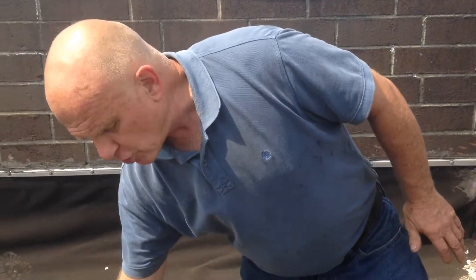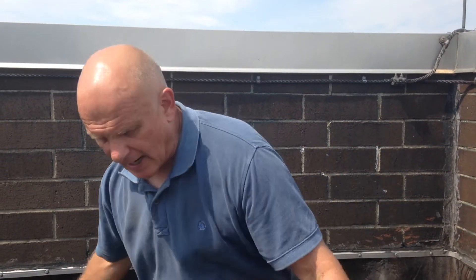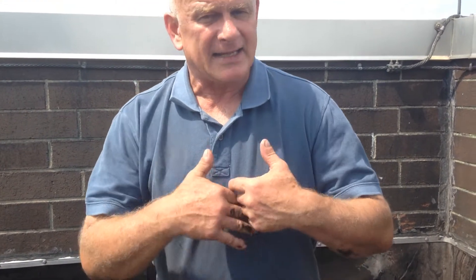But this is not the end of this roof. The best thing to do is to add another ply. We call this a single ply roof — now you add another ply of the same material on top and fuse it together. It becomes a roof that's indestructible, exponentially much better than a single ply. It's not just another 20 years — you add another 50 years to the roof because you're fusing the two layers together. That is an unbelievable roof.